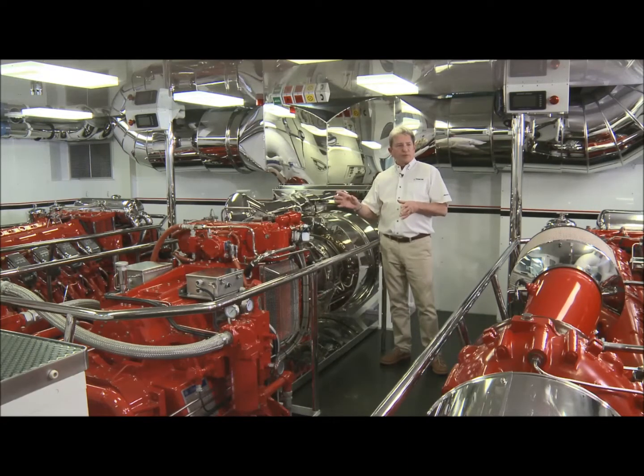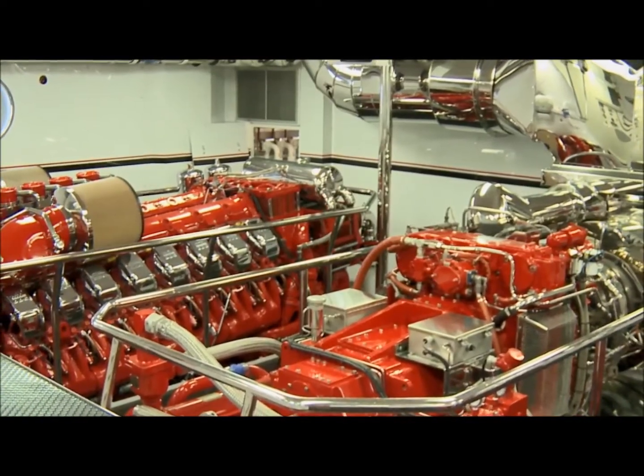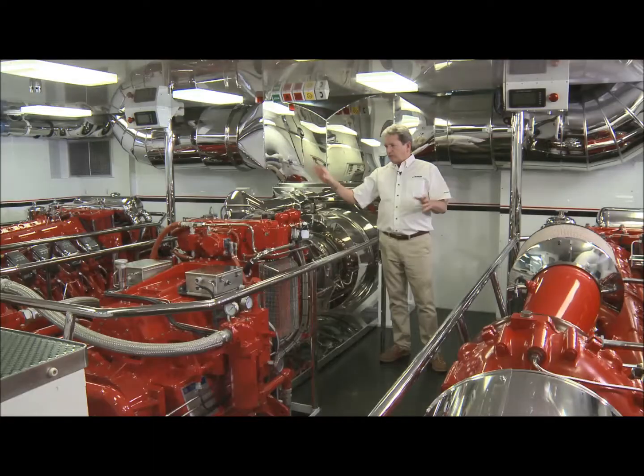This package is on board this vessel with diesel engines on either side of me. This is a combined gas turbine and diesel engine arrangement — two diesel engines and a center boost gas turbine for a typical high-speed propulsion package arrangement.